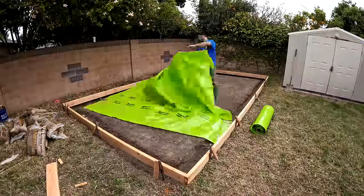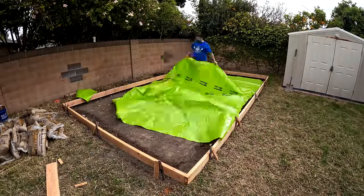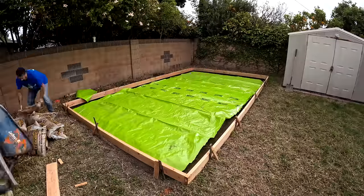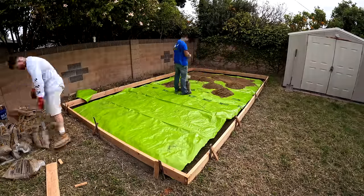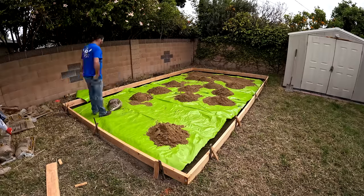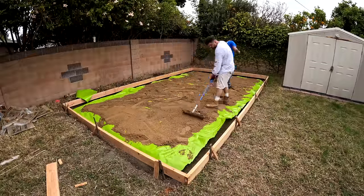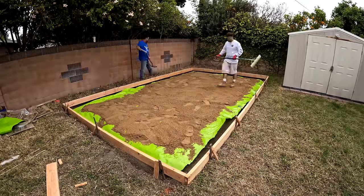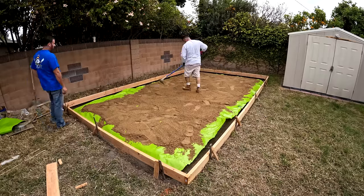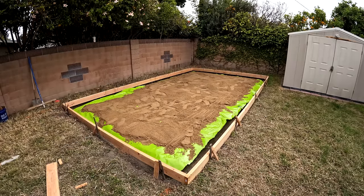I was messing around at the end checking to see if it was still square by the time I got back to the beginning, and it still was. I ran a quick 3-4-5 just to verify. I went corner to corner all the way and I was only off about three-eighths of an inch diagonally — that's pretty good in that span. I'm not really concerned with it; it's basically virtually square.